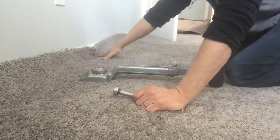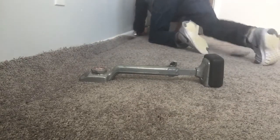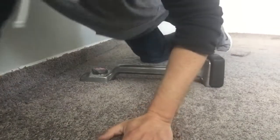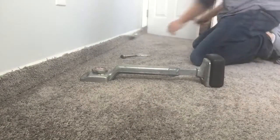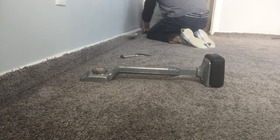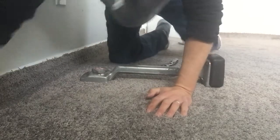We have our starting wall here and I'm just going to crease this on. On different types of carpets you may want to actually kick on your set wall lightly just to get the pins into the backing. But with this type of carpet it's real easy to crease it on and have it stick into place. This is creased on nice and tight — you can hear that grinding. That's the pins going through the backing of the carpet holding it in place. That's the wall back there that we just creased on.